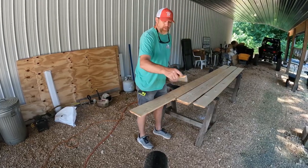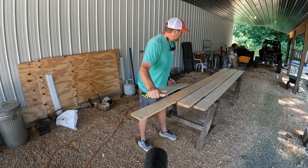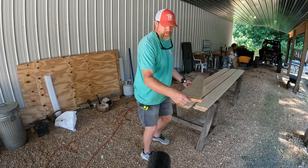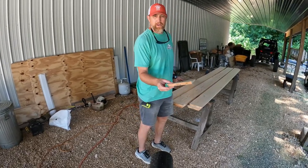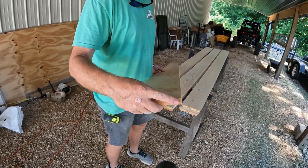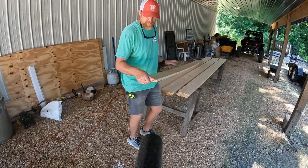This is the bottom, the end result. We've got two 45 degree miters for the bottom of the beam, but the sides of the main beam, I have ripped one side, which is the bottom, which is a 45 degree bevel. The top, which the ceiling is going to be vaulted at a 6/12 pitch.